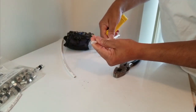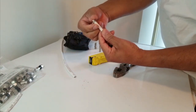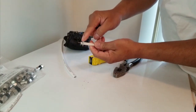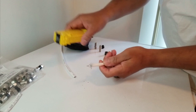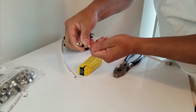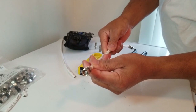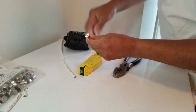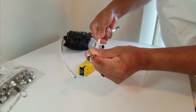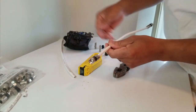Cut and strip it just like that. You've got a little braided shielding over the line — that's what keeps it strong. You want to fold that down, but you don't want any of the braiding touching the copper. You have a little bit left over, so you take a connector and slip it on there. You want the white dielectric area to be flush — you never want a cut where it looks like it's sucked in. That's what we call 'suck out' in the business. Bring it down until it's flush.